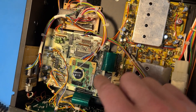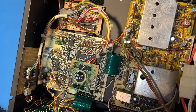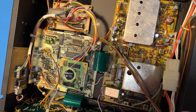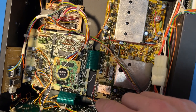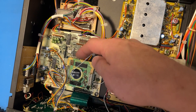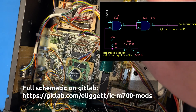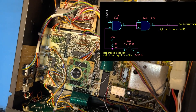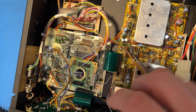This is the PLO — well, this is the digital logic board with the CPU, and then this is the PLO board over here with the stabilized crystal. For the transmit/receive to not go into split mode all the time, that's what this little white wire is here. I changed the speaker switch so that it toggles this wire between ground and float. I used an unused pin, brought it up to here, tapped it off the back over to this board. I AND the position of the speaker switch with the radio's own desire for transmit or receive bank, so if the switch is turned off it just stays on the receive channel the whole time.